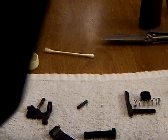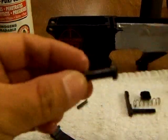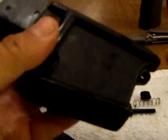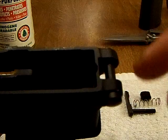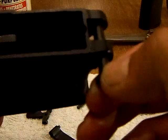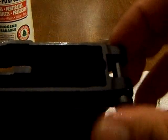The first thing you actually want to do is take the pivot pin and make sure that it fits well. It's going to go into the front of the receiver — you can see how the head fits in just like this. As long as it slides in pretty easily, that's good. Even if it's a little tight, as long as you don't have to hammer it in that's okay, because as you work with and clean it you'll be taking the pivot pin in and out and it'll eventually wear itself in. This is a pretty good fit.